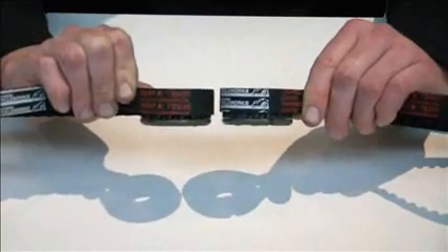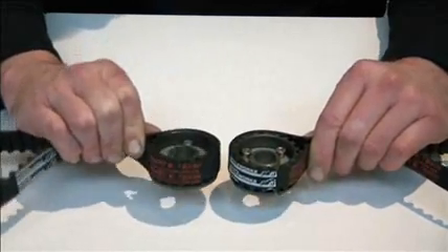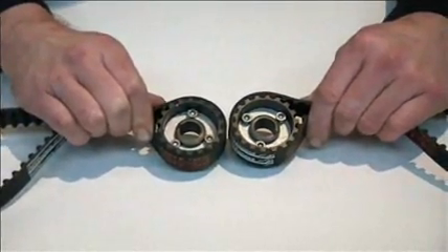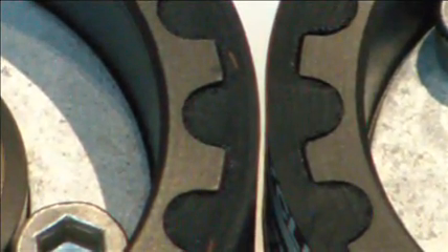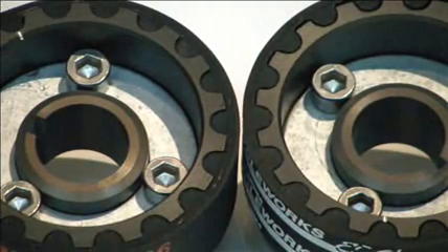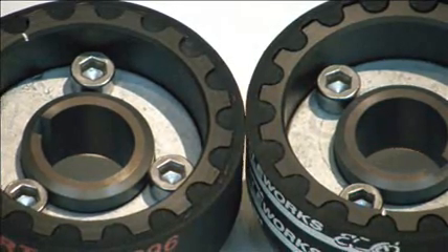Initially, the only difference appears to be the width of the belt. So I was proposing that we made the 696 belt work for both — they had the same number of teeth, the same tooth pitch, and the thicker width would only be more reliable for the 900. However, the engineer said that the tooth profile is different between these two belts. I was actually a bit surprised, because if you see these, the tooth profile really does seem identical. Whatever the difference is in the tooth profile, I am amazed at the difference, and they simply recommended that you do not mix tooth profiles — you really do want to not use the 696 belt on the 900s.